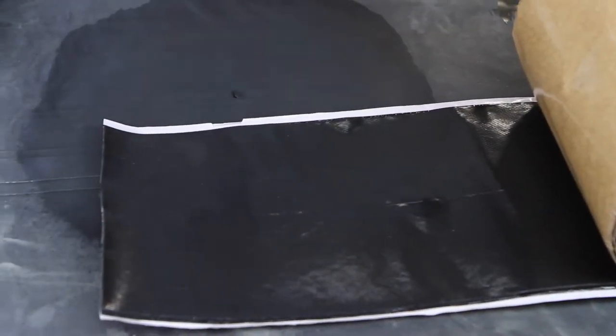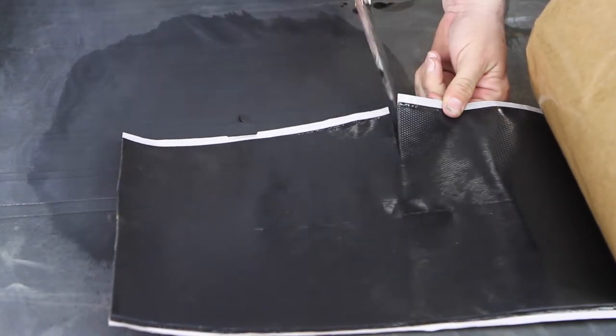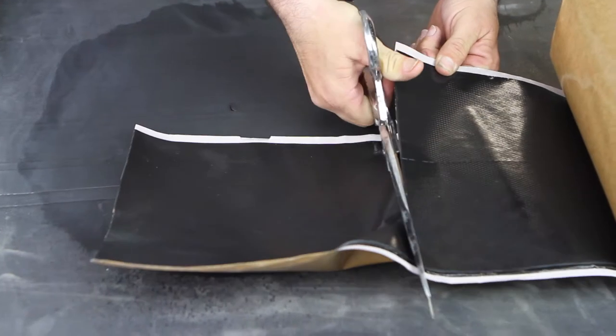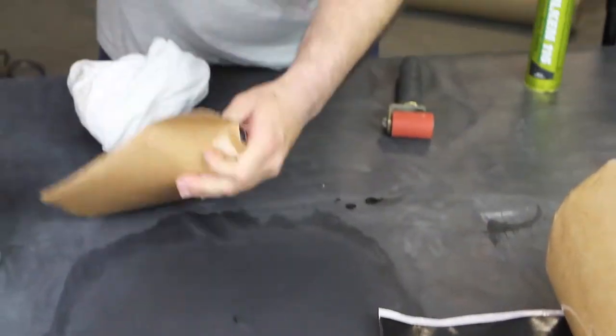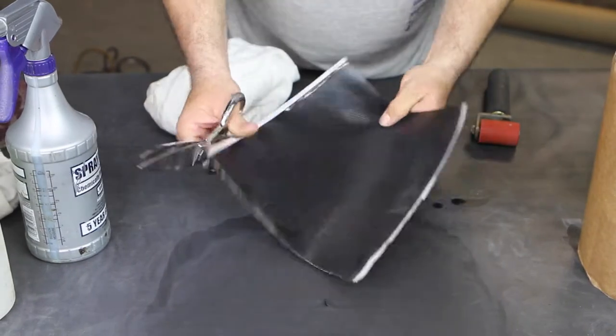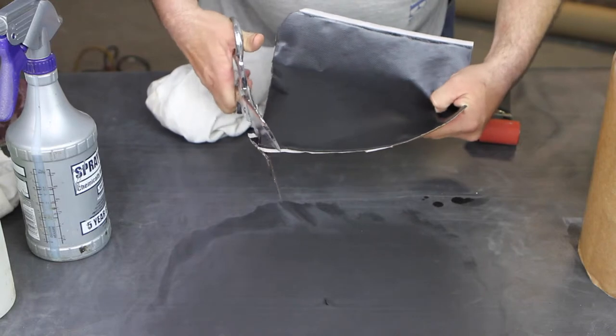What we're showing you here is called an elastiform flashing. It's basically a self-adhered tape. It's got adhesive on the back of it already with a release paper. And the technician is going to cut the patch sized appropriately, which should extend 4 inches beyond the edge of the penetration. You want a good 4-inch seal all the way around your hole.